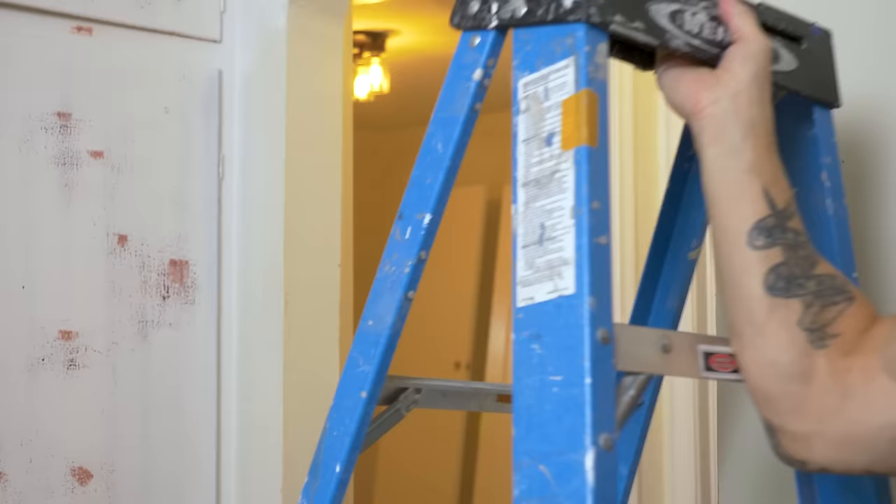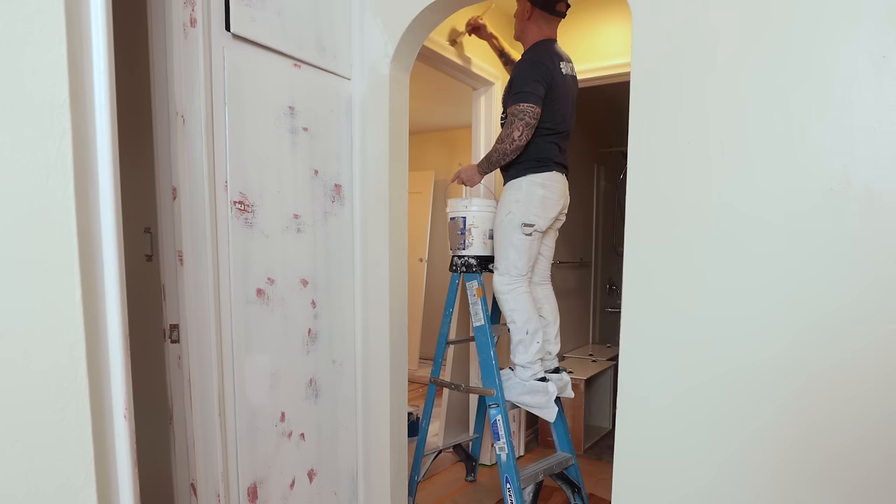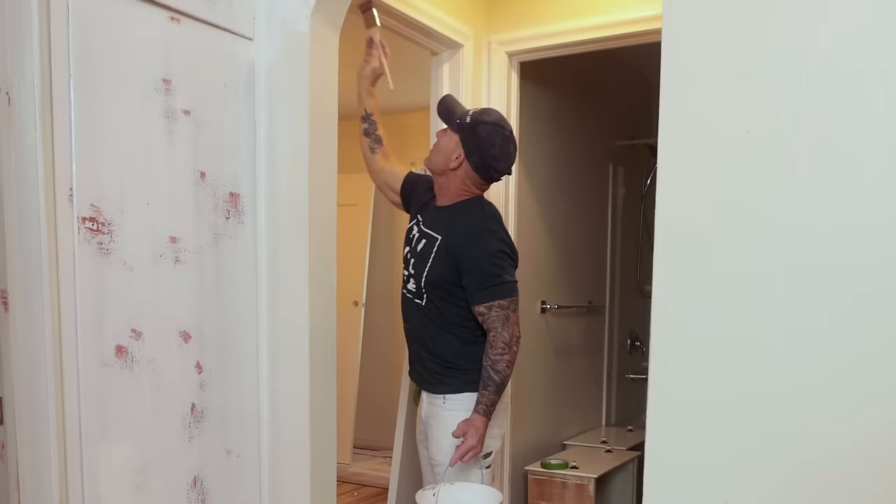If I'm doing a large surface, I grab my ladder because I want to hit the tops of these door jambs. It's amazing — nobody had ever painted the tops of these things before. We definitely want to paint the tops so they're not bare wood, and it makes them a lot easier to clean.